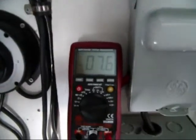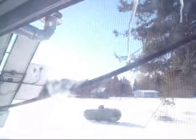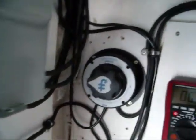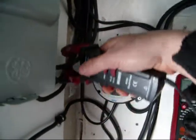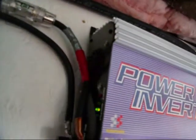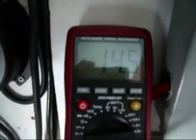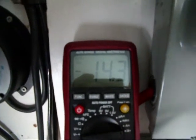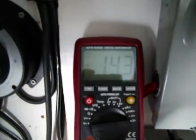I'll try to update it later. It's partially cloudy — not bad, you know. A couple of clouds in the sky, but all in all it's a pretty nice day. It's about noon. So those were the 250s. Now these ones are the four Sharps. The four Sharps are feeding the 500 right now — that's the only thing they're doing all the time. And they're putting in 14.4 amps — I saw 15 amps, so we'll say 14 amps. Those are the four Sharps.